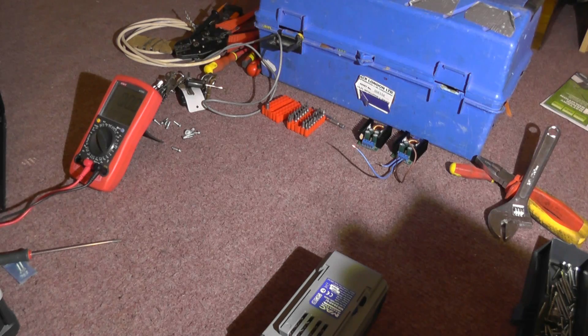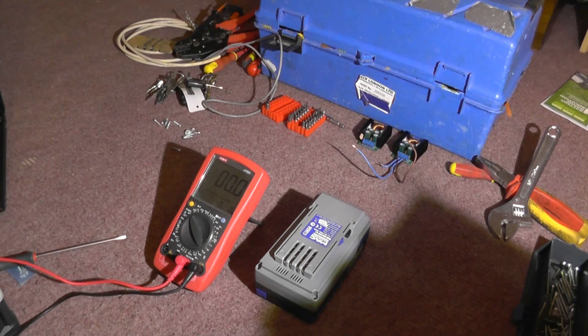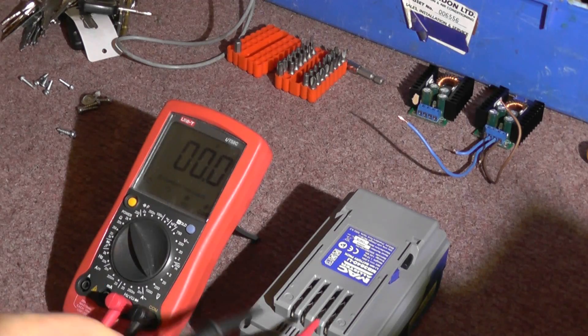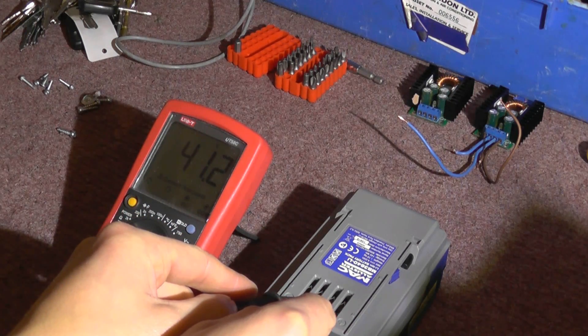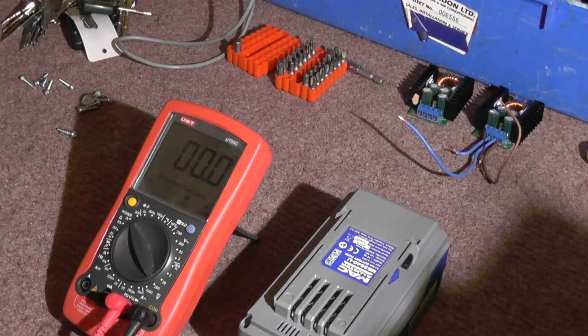We show positive on one side, negative on the other. So we would expect to get about 40 volts - 41.2 volts, that's not bad. If we take 10 lithium-ion cells and put them in series, you normally get around 42 volts. I believe this charger is set up to slightly undercharge them, which is good.